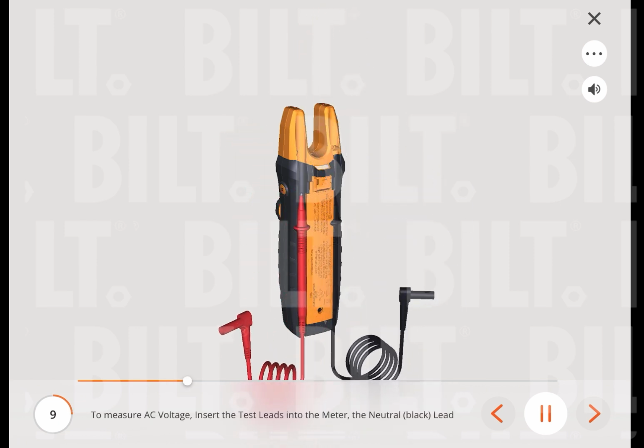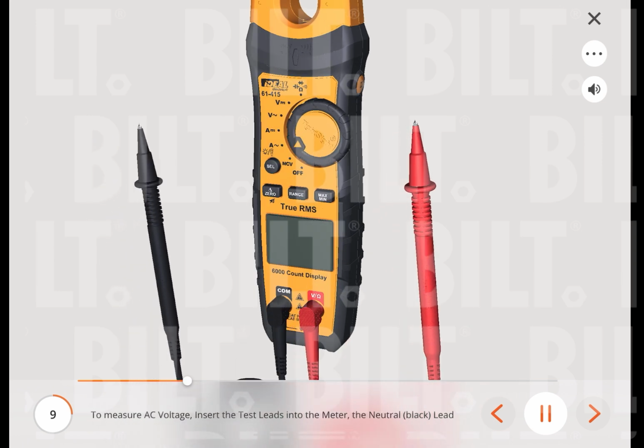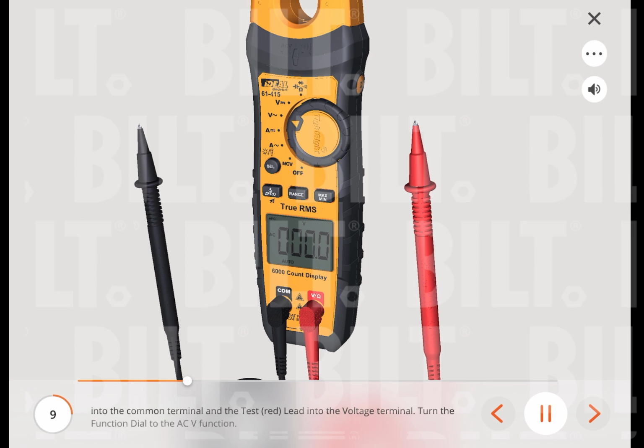To measure AC voltage, insert the test leads into the meter, the neutral, black, lead into the common terminal and the test, red, lead into the voltage terminal. Turn the function dial to the ACV function.